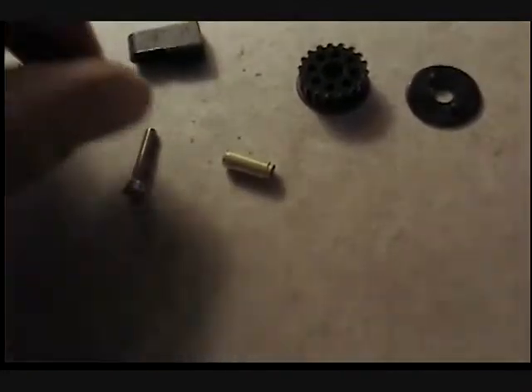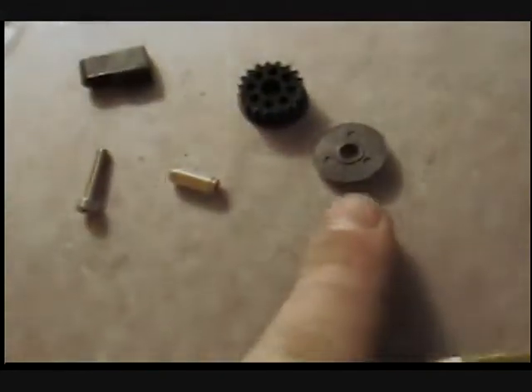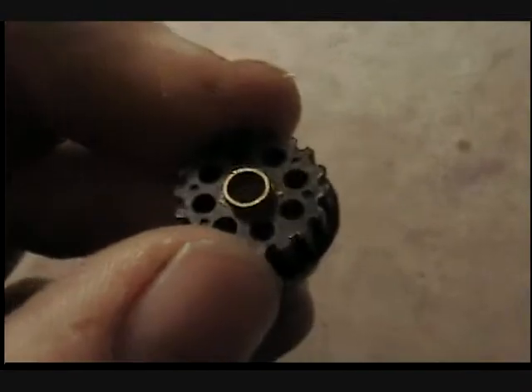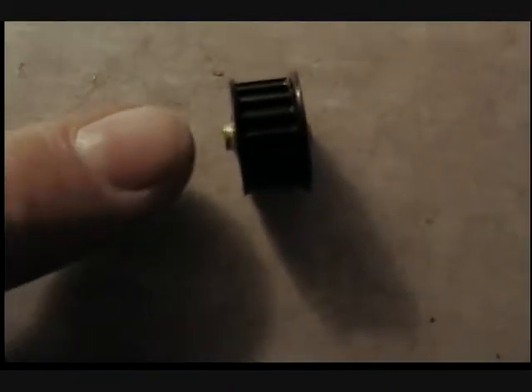Sorry, I'm trying to do this with one hand. That'll go inside there — that's giving me enough space. Then I'll put a washer on each side that holds the gear cover on. The bigger of the two brass bushings is hot glued into the pulley. Notice it does not protrude on either side. I'm going to take my smaller piece of brass tubing, set that guy in there. It's a little long. I'll put a washer on each side to take up the slack, put a bolt through it, and then thread it into my servo mount.